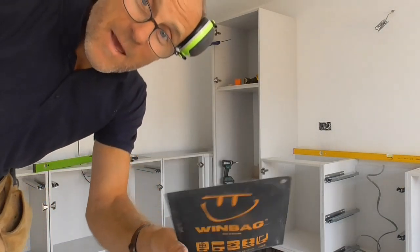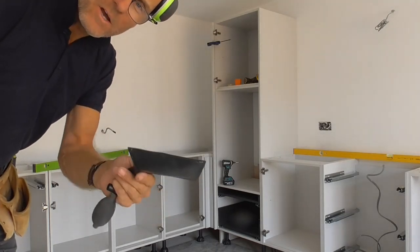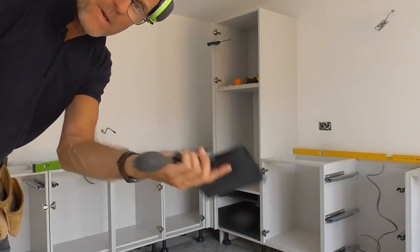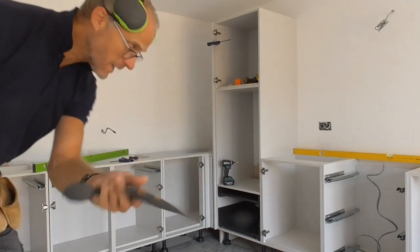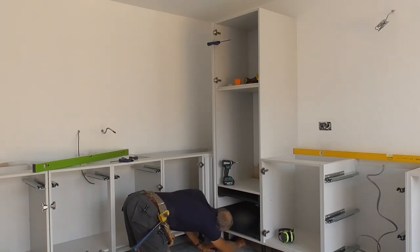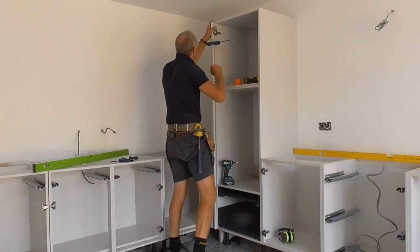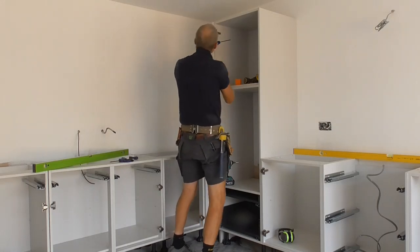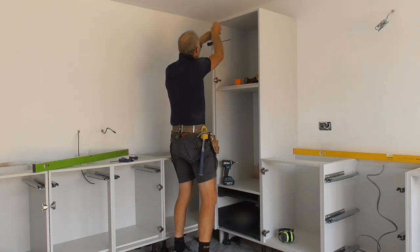This is where these airbags come in really handy, and there's a gap obviously that I haven't tiled all the way back, so I can still get this underneath and just pump it up that millimetre until I get it absolutely perfect. Brilliant bits of kit, use them all the time. Let's pump it up! There we go. Oh, dreamy. Got a real 22 mm packer. Bring that forward.